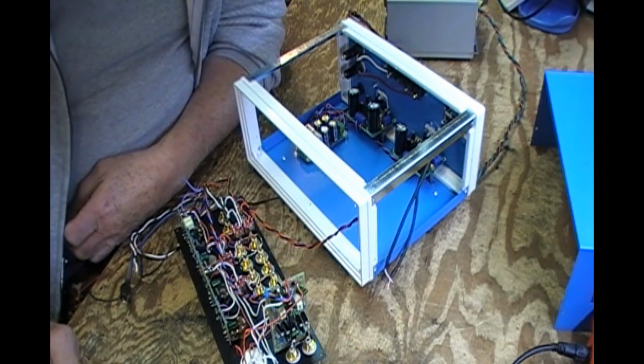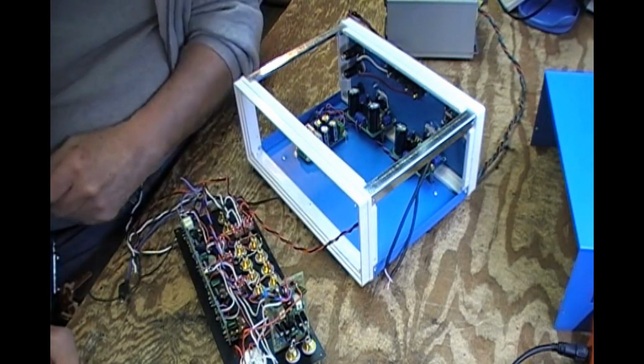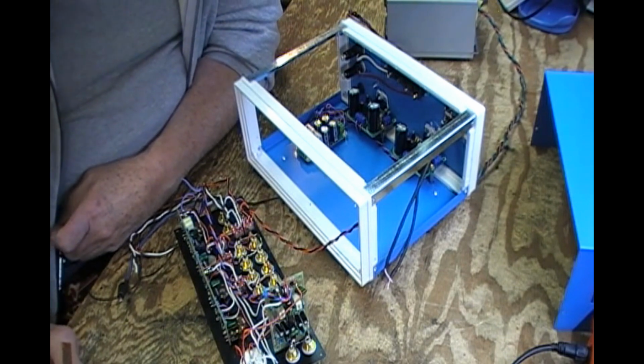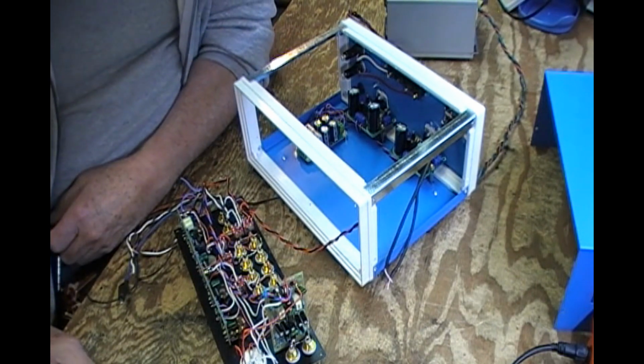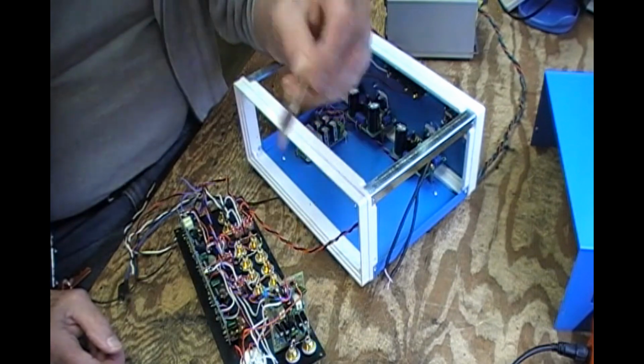Previously, I would have to grab a turntable, hook it up, put a record on, and take up bench space, which is at a premium here, in order to test the input. With this, I can take whatever's being fed through, a CD, the tuner, a test oscillator, anything, and run output to that, to feed into an amplifier under repair where the phono input is a problem. And that I like, because it's been real clunky having to have a turntable on the bench for that repair. However, I've got the components, I have to put it together. I'll see how it goes.